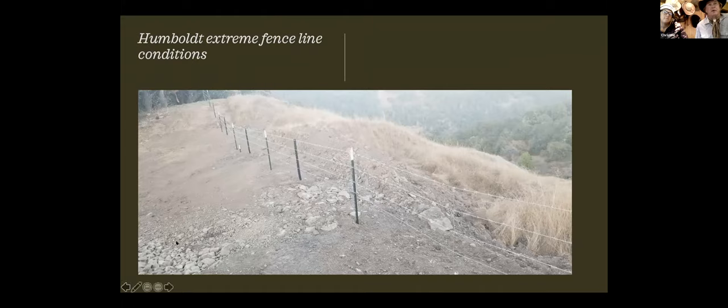You can see the deadman anchors placed in the low spots, and where it breaks over the hill there's a three-and-a-half-inch stress post with the curly connectors, so we're able to span that out a little bit. The customer that did that was supposed to be online — Hunt Ranches. Dean Hunt is actually here with us online right now.